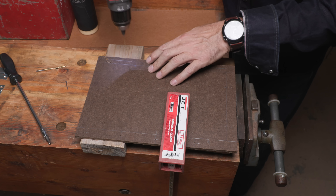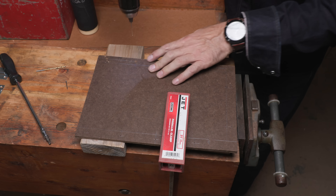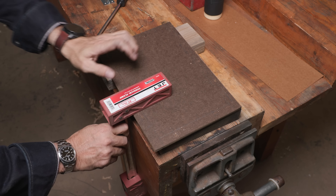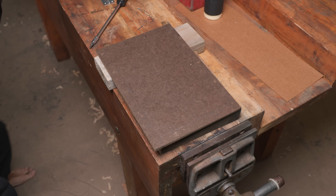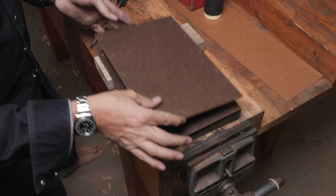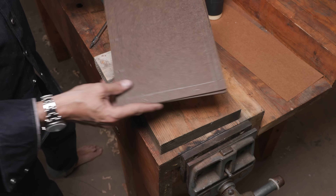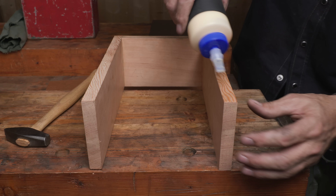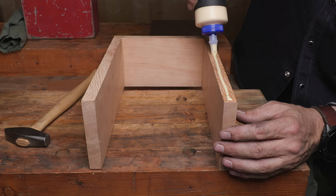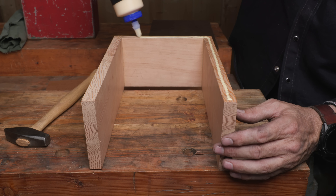I've laid out the nailing pattern of the original — we've got five on the side and two. I'm going to pre-drill this tempered hardboard; it is really hard, and I have a suspicion it will chip or split if we try to drive a nail through it. So this is a 1/16th inch bit — really small. My father was a master carpenter and he always taught me to use and make patterns whenever possible. Lay out one time and use that over and over again to transfer marks rather than measuring everything. It saves you hundreds of hours of time.